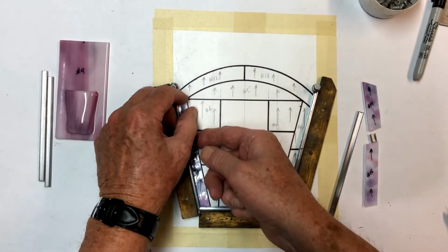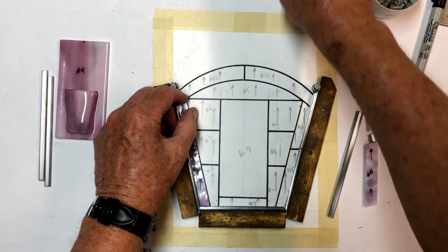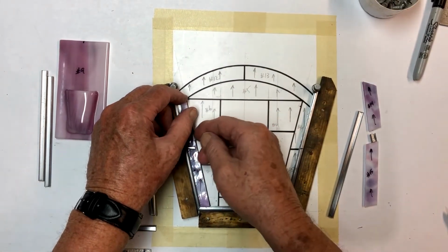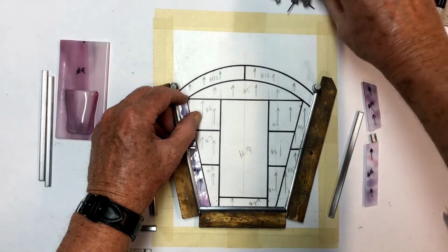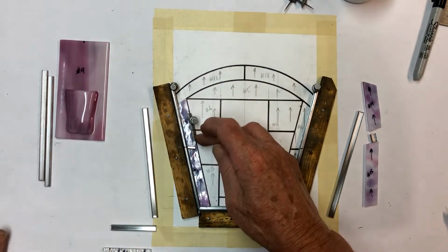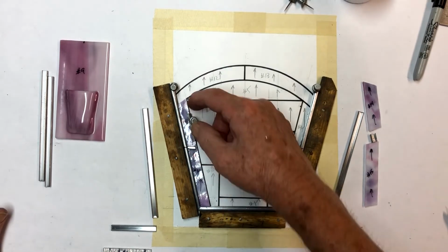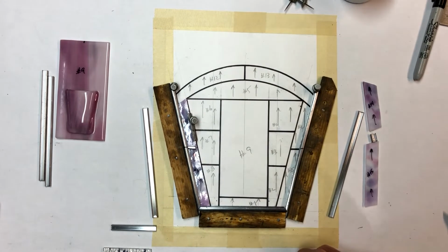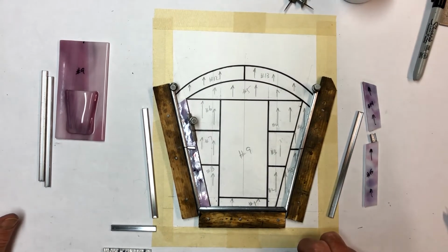just like that. Now I'm going to take a little piece of our old U-came, stick it in here, and we'll get a little pin here, and we're going to hold that with that. We're using the old U-came to keep the pin away from our glass, because otherwise you're liable to chip the glass. A lot of times if that happens, you won't notice it until it's all done, and then when you hang it up, you'll see a big chip out of it.